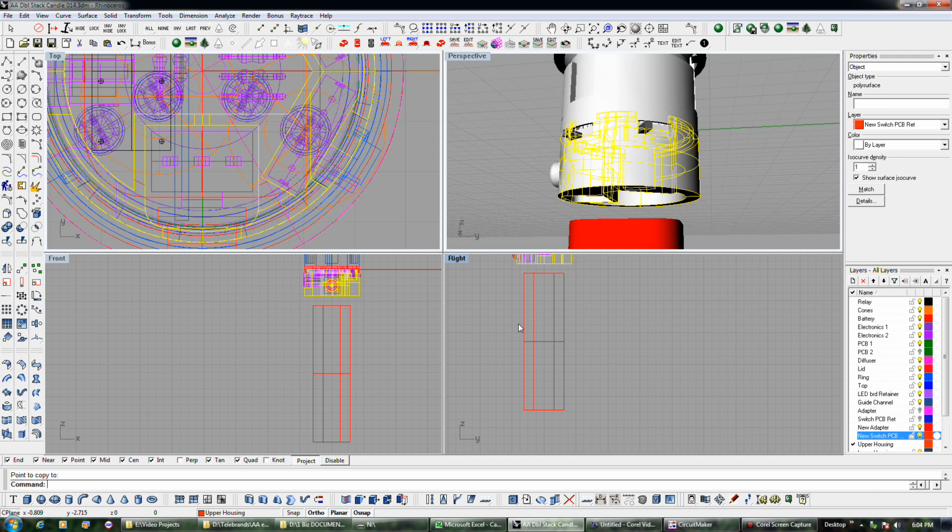That's pretty thick. But again, I've never actually printed threads in a 3D printer before, so I don't know what result I'm going to have. The only thing I do know is I'm going to have to use triangular threads. Beyond that, I've never tried printing a threaded object before, so this is going to be a first. I'm going to try to size things fairly large, because there are limits to resolution on a 3D printed object, and it's still not going to smoothly slide because of the layered nature of it.